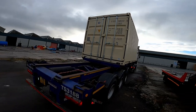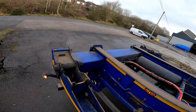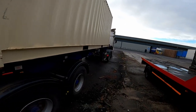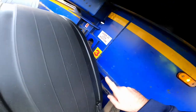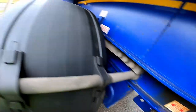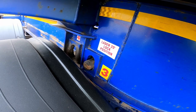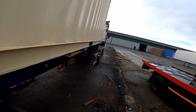As you can see, the container is in the middle of the trailer. First thing you want to make sure is that these things are in this position — if they are up you won't be able to slide the container all the way back. First thing we're going to do is pull the park brake. See these pins right here? This is in the 20 lock position. We press this button and you can see them starting to retract. If they're not moving, don't worry — as soon as you release the handbrake they will go in.